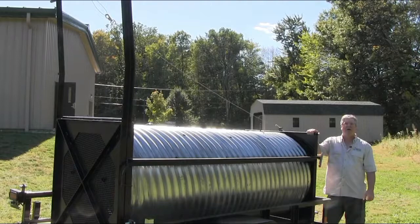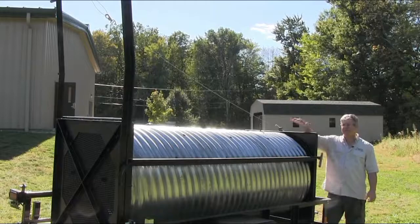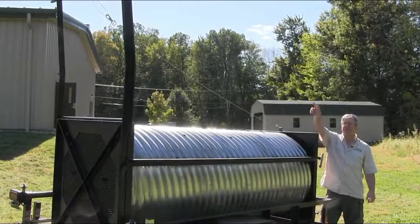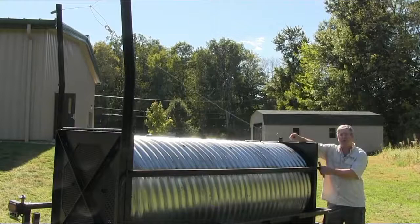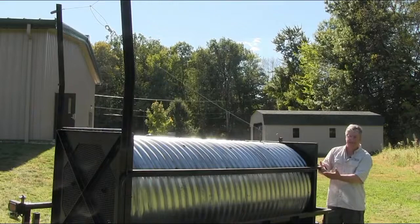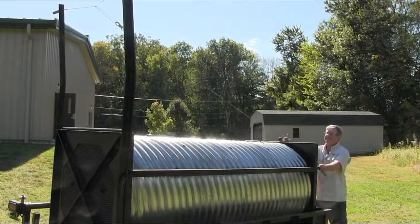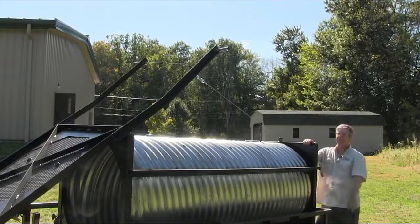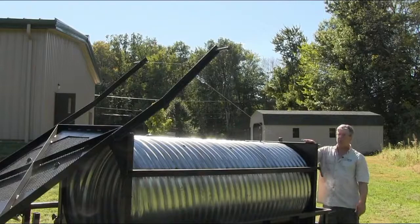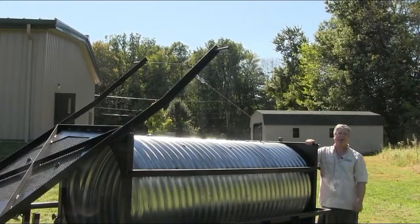I've come around to the rear of the trap to release the bear inside the culvert trap. You can see I've attached a cable to the cross arms of the trap, running all the way to the back. I disengaged one lock on the door earlier, and I can release the second lock from the rear of the trap with this handle here. By disengaging that lock and pulling back on the cable simultaneously, I can release the bear — and that's the way it looks. A bear is going to run out, and you don't need the door open any more than that. You're all the way to the rear of the trap, not on top of or in front of the trap when releasing the bear, as is common with some other traps on the market.